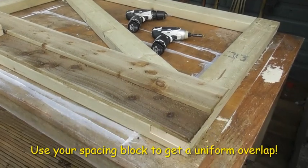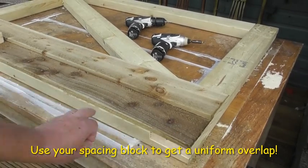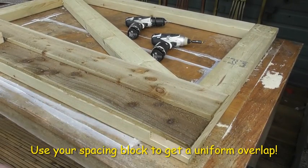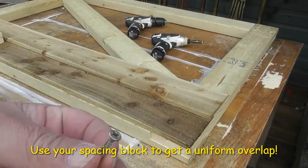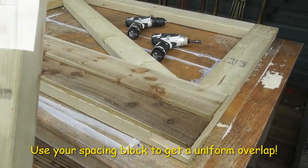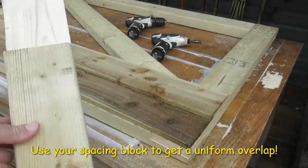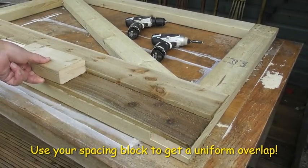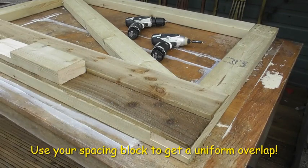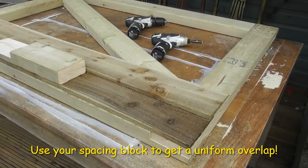Right, we now come to the exciting bit. So I put the first board in, just make sure it's completely square and level both ends, and I'm actually screwing it in today with some little 30mm screws, just think it will look better, and it'll hopefully hold the boards nice and tightly. So then when you put the second board on, you want your old faithful spacing wood, so if you use a bit of your old 4x2 and just use that, make sure it's absolutely accurate along the side of your first board, as long as your first board is accurate of course, and then lay in position